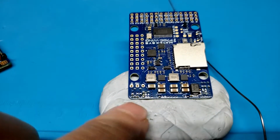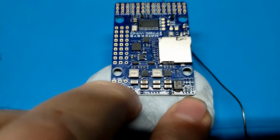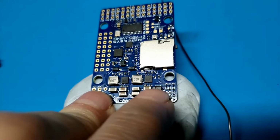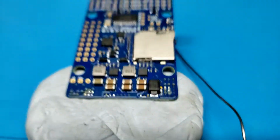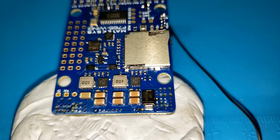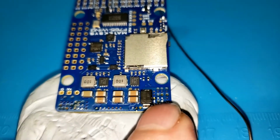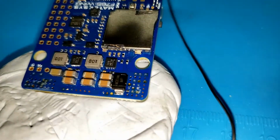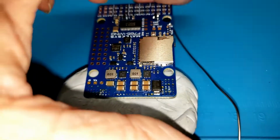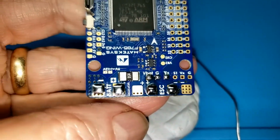And some of those solder pads have holes drilled all the way through them. I forget what you call that and what it's for. But I got just a little frightened right there that some of the solder had come through those holes and might have been shorting this component. But as I got closer to that component, I could see that the connections for it are on each end, and the little bit of solder that did come through those holes right there is not going to short anything out. So I'm going to let that side cool down from tinning those 7 pads.